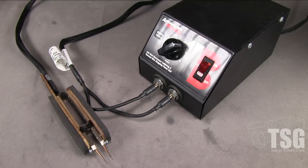In certain situations, a resistance soldering set might be useful, especially if you're working on a brass locomotive or something. The advantage this has is it applies heat only in a very specific location, so you don't end up unsoldering a bunch of other stuff while you're trying to solder the part you're working on. Yeah, that happened to me once.